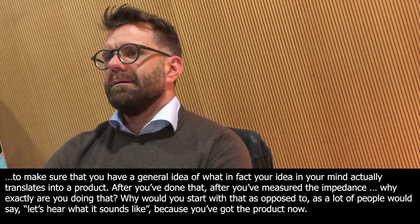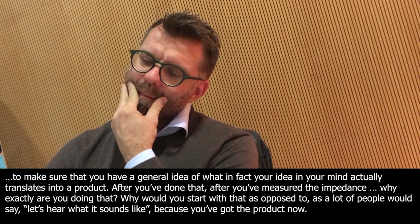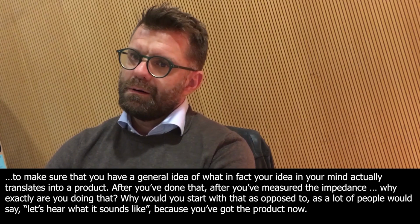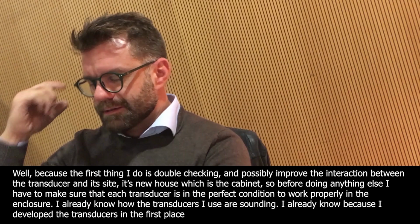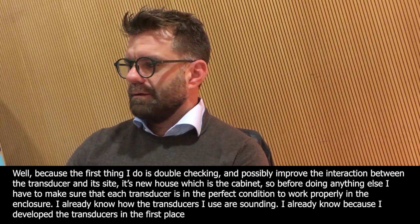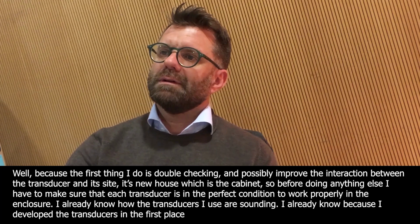So now, after you've measured the impedance and so on, why exactly are you doing that? Why would you start with that as opposed to, as a lot of people would say, let's hear what it sounds like, because you've got that product now. Well, because the first thing that I do is double-check, and possibly improve, the interaction between the transducer and its own seat, its own new house, which is the cabinet. So before doing anything else, I have to make sure that each transducer is in perfect condition to work properly in the enclosure.